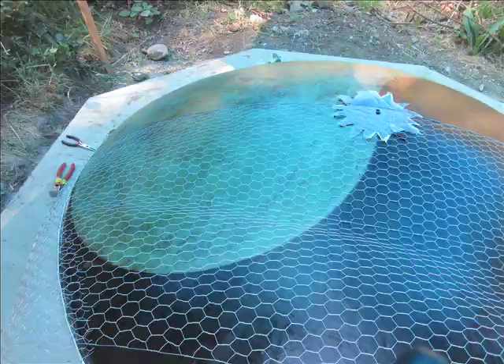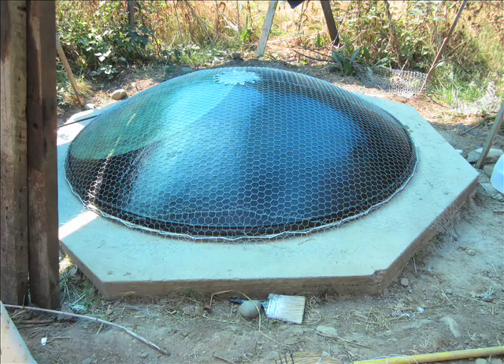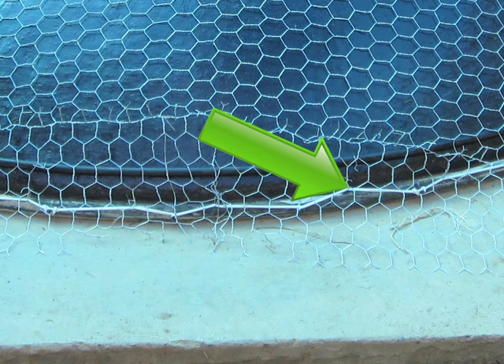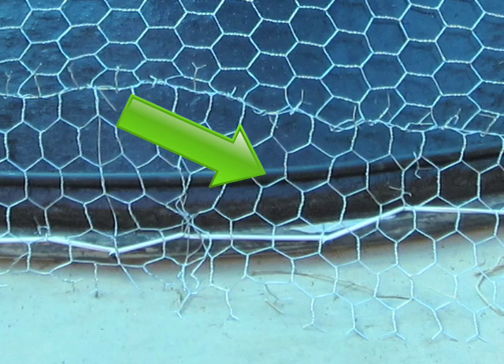For reinforcing mesh, I applied two layers of chicken wire, pulling it tight and securing it to the wire along the perimeter base ring. I tightened down areas of loose mesh by twisting kinks into the mesh with pliers. In order to clearly define the edge of my dish, I installed some stiff three-eighths inch plastic tubing underneath the mesh along the perimeter of my mold.